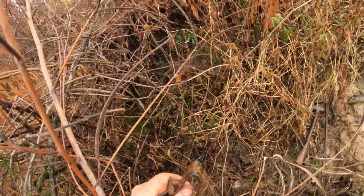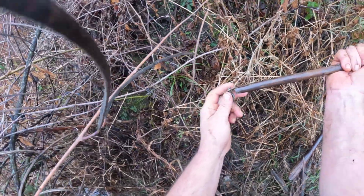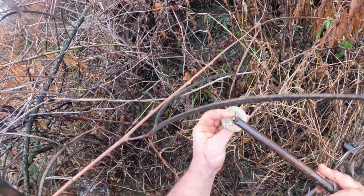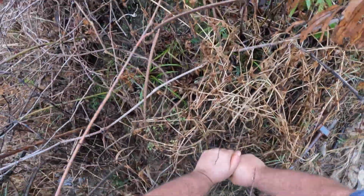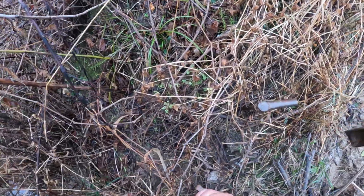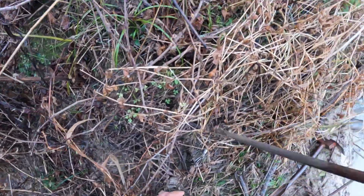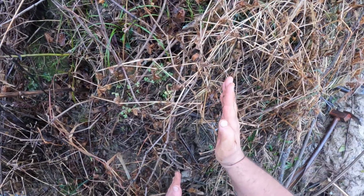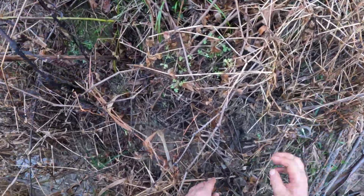So we'll do a long spring here. Just using our pogo driver, guys, and our pogo anchor. That washer's just gonna slide in there to where that nail rests in that groove. We're gonna push it down best we can, then we're gonna knock it down in there a little bit farther. All right, guys, so we got it in there. Now we want to give it one good tug, because right now that washer is up and down. We give it a good tug, that washer is going to flatten out, and that's what's going to hold.